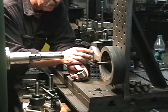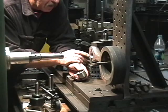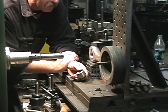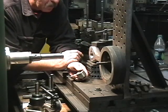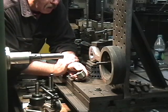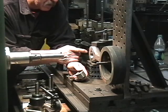I offset 9 inches and 999 thousandths instead of 10. That means if I've got a hole that is more or less true with the world, then I have a bore that's 9.999 away. If the hole moves down or moves up — because they do — I put them back where I got them. If it moves down or up, then I've got a longer distance. I'm actually working on the hypotenuse of the triangle, and it adds about a thousandths if you get to three-sixteenths of an inch — a little over a thousandths. So you actually are just a touch over 10.